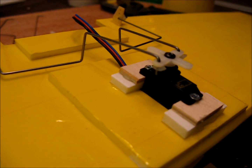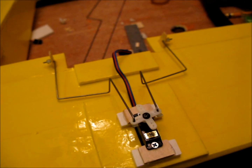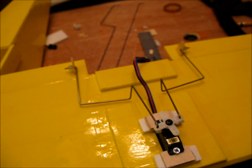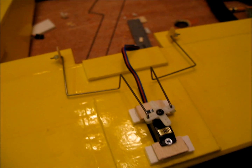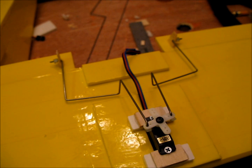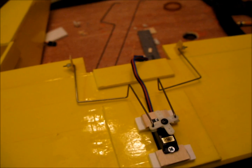I did the same thing underneath the edge of the servo horn — just for cheap factor. I've actually crashed a plane just like this using that method of holding the linkage on a whole bunch of times and I've never had the linkage pop off, not even once. I did a nose-down crash from about 50 feet in the air, so I think it holds alright.